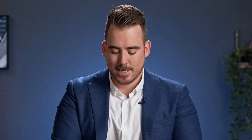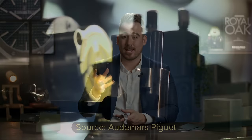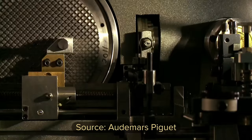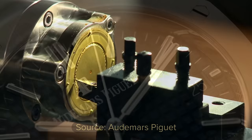The way Tapisserie dials are made is actually with a Burin and a Pantograph. Imagine a big coin maybe 10 times the size of this dial that has the same pattern — you put it on the machine, which is essentially like a copy machine. The Pantograph reads the big coin which has the same pattern and then copies, or translates it, to a smaller dial. When I visited Ossilian Watches in Zurich, I actually had the pleasure to see this in person.